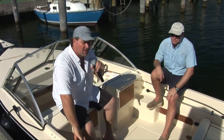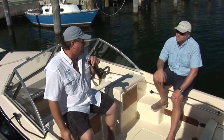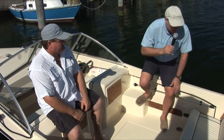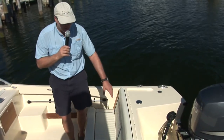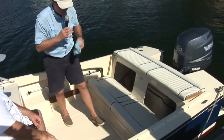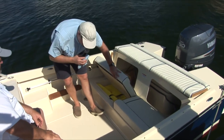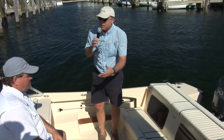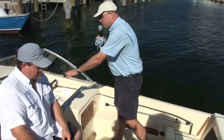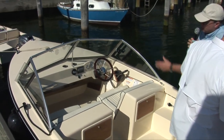The liner is pushed out against the hull, so rather than a traditional two-piece boat which brings the liner in six to eight inches, you get a lot more room inside. You also end up with a whole lot of storage cavity capacity. You have drained storage bins in the liner on both sides — in this case we've got some life jackets under there. In a 17-foot boat you get a lot of open space because of the three-part construction, plus storage underneath your front and back seats — everything drained, with lockable cabinets behind the seats and storage under the bow.